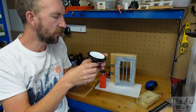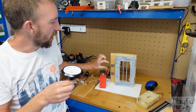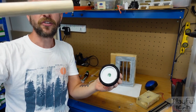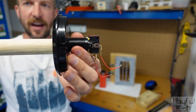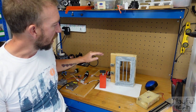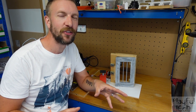When both C4 reed switches are closed with the charges in position and the plunger is pressed — pressing down on what is effectively a broom handle — the circuit is complete. This activates a relay which de-energizes the mag lock and the door is released.